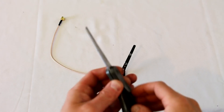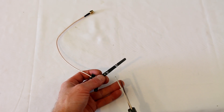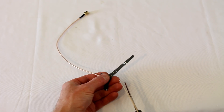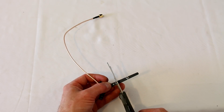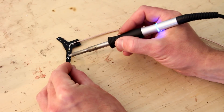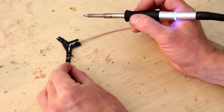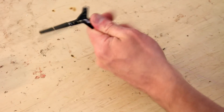Tuning can be done with a simple pair of household scissors. Along the length of the antenna, each common FPV frequency is marked by a set of notches, as well as two plated holes where the signal trace passes through to the other side of the antenna. Simply cut at the notches straight through the holes to tune to a new frequency. And if you're somewhat familiar with the soldering iron, you can even solder the cutoff parts back to the antenna and retune to the lower frequency.